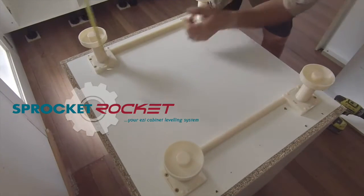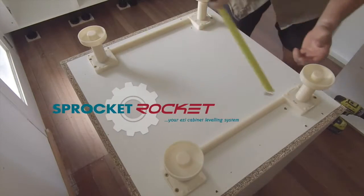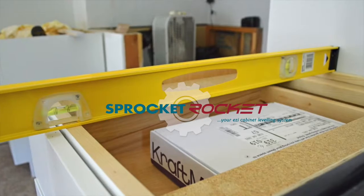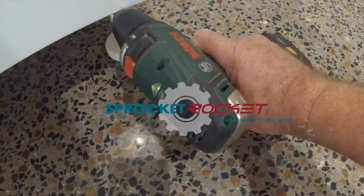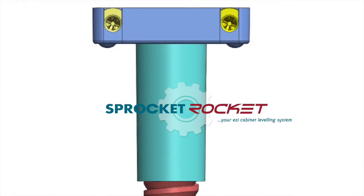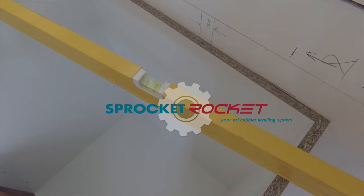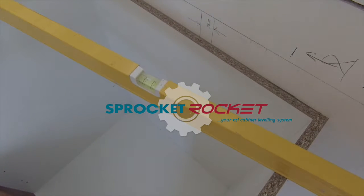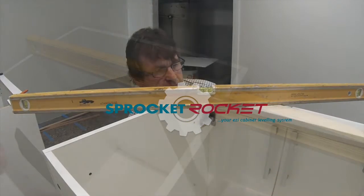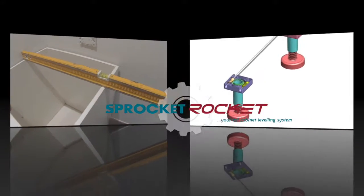The Sprocket Rocket puts all other leveling feet in a spin with its simple and convenient two-step leveling action. Place your level on top of the cabinet and with a standard number 2 Phillips head screwdriver bit in any drill or driver, simply install the tip into the control port at the front of the geared assembly and pull the trigger. Amazingly, your Sprocket Rocket Easy Cabinet Leveling System does the rest, adjusting both front and rear feet in one quick, simple, synchronized movement.